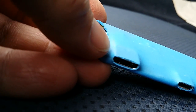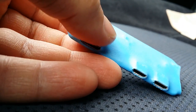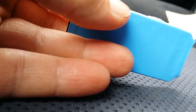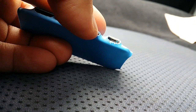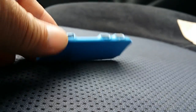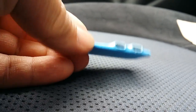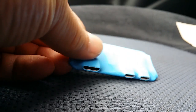Since this is tubing for electrical wires, it's electrically isolated, so you don't have to worry about shorts or placing it on metal objects. One caveat: the shoe the Pi sits on might be grounded, so there could still be an electrical connection on the negative side, meaning shorts might still be possible.